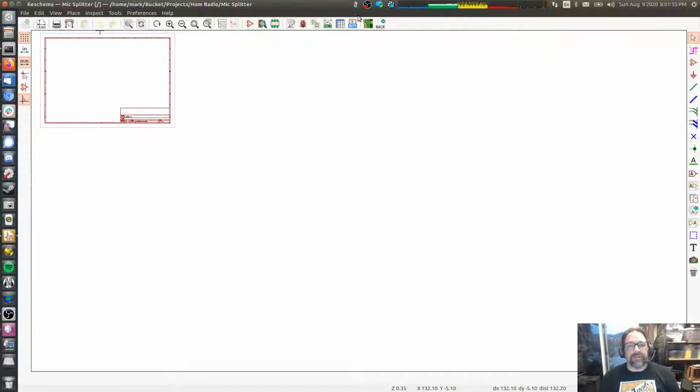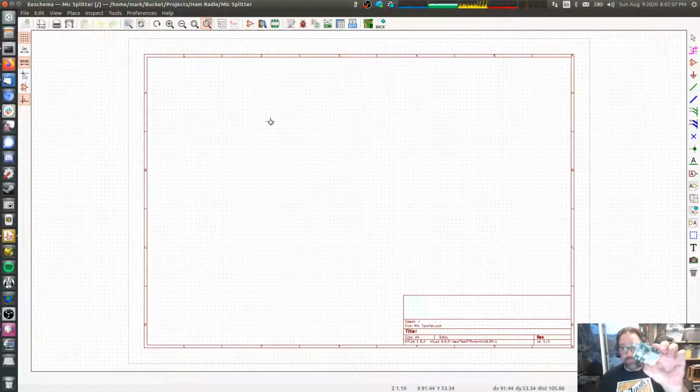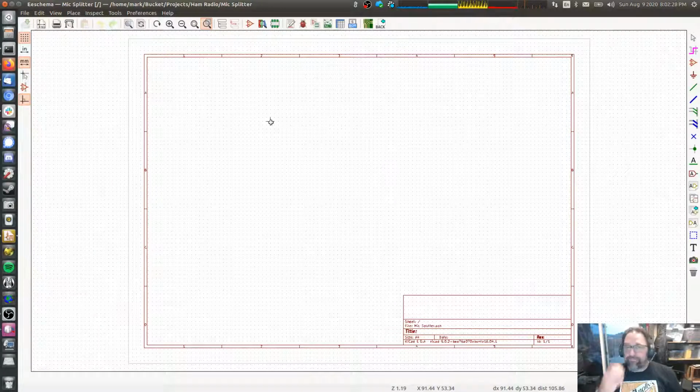That is a very tiny window. That is still a very tiny window. Okay. So the first thing we're going to do is look into power, because that's the part that I think I'm having problems with on this board. USB power is notoriously noisy. It is horrible. Absolutely horrendous. There are ways you can clean it up, and I tried doing at least a little bit of passive cleanup on this, and apparently it wasn't anywhere near enough. So we're going to look into that.